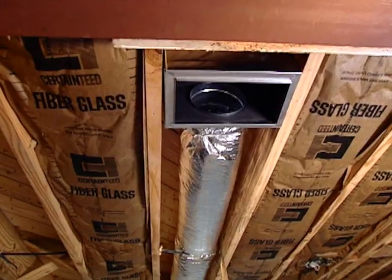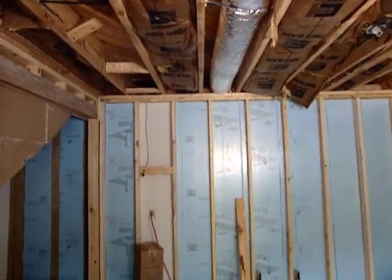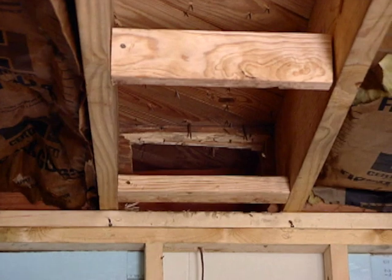Okay, well, you're moving along great on all of this, and I noticed that the air conditioning man was in earlier and was able to get his ductwork in, but it goes into that wall and disappears. I guess the unit will be on the other side. Well, yes, it is. Originally, there's a crawl space behind that existing wall right there, and we were able to put the unit behind the crawl space, which turned out well for us because it eliminated any furr downs that normally would go into a structure like this to get the AC and the ductwork in. Good. And also it saves a lot of square footage because you're not dedicating any of this floor space for the actual furnace to position in. You're able to position it behind the wall. That makes a big difference. It surely does. It eliminates anything from going into the closets and gives them all that open space which they really need.